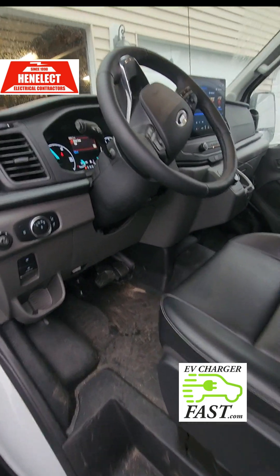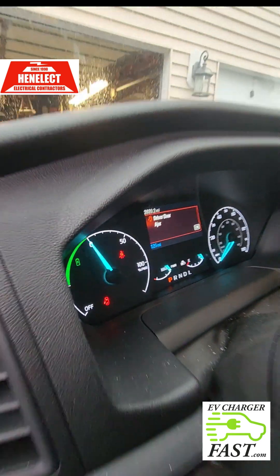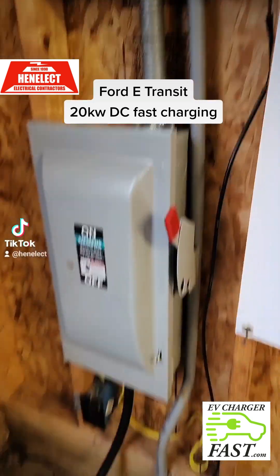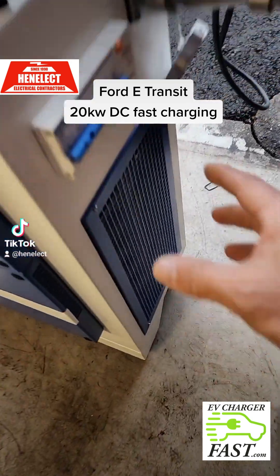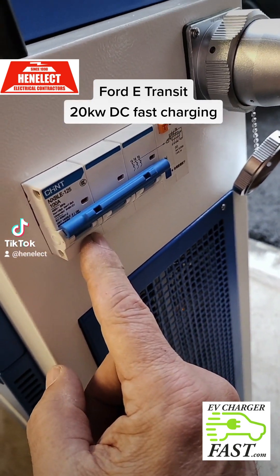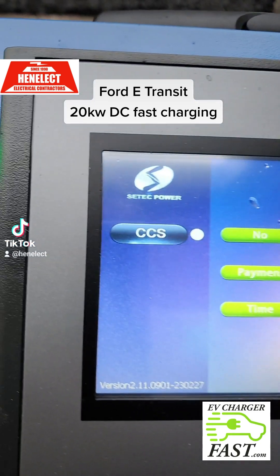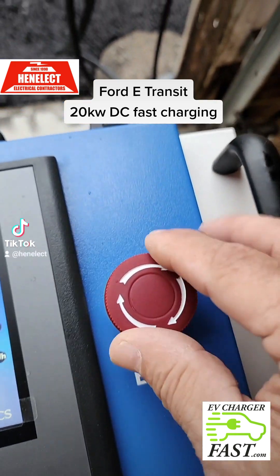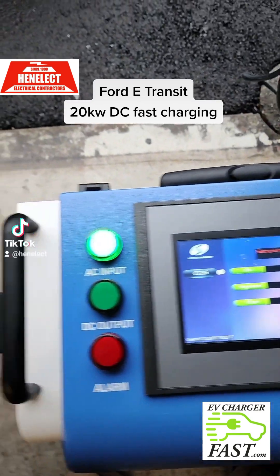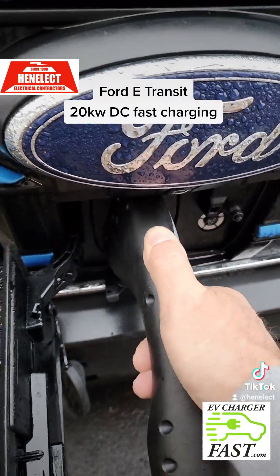This van is fully charged. For me to do this test, I actually just turned it on and you can see it's showing 125 miles of range. What this does is takes in 100 amps and converts the 100 amps AC to DC right here — there are two 10-kilowatt modules. You can see the lights that are on, so you can make this a 10-kilowatt system. There's a 100-amp shunt trip circuit breaker, the inlet connector, a screen giving us our options, and an emergency power off switch.